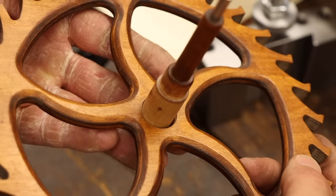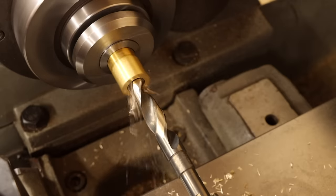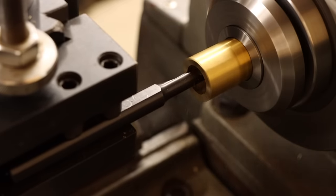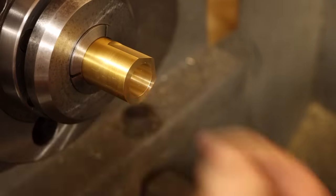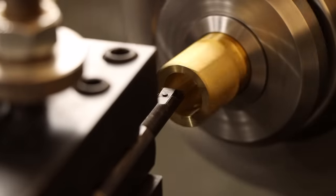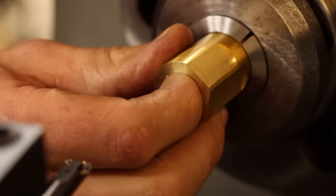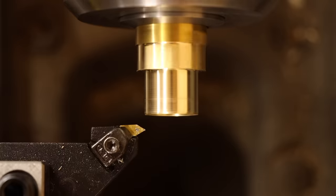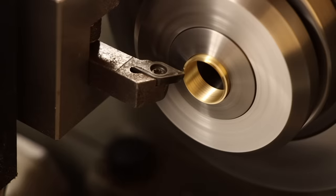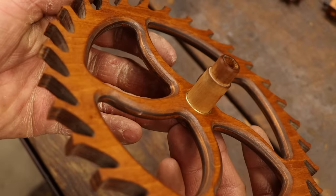While I'd like to stick with the tradition of wood on this clock, I think the smarter decision here is to use brass. I don't need much, so a scrap piece from an old project will do. I'll start by drilling out the bore one size below my final dimension, then finish it with a boring bar to match the hub diameter — it needs a very close fit on both ID and OD. Since the fit is so close, there isn't much room for glue, and the smooth brass surface doesn't help with adhesion, so I give it a spiral texture with a quickly fed 10 thou boring pass. The outside is a similar process, whittling down the diameter until it's a perfect fit for the wheel bore, then adding a spiral texture before parting it off. After a brief cleanup on the opposite end, the bushing is finished — a perfect fit on both the hub and the wheel, and it actually looks like an intentional decorative feature.